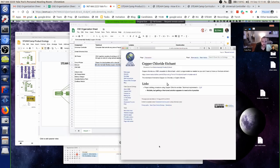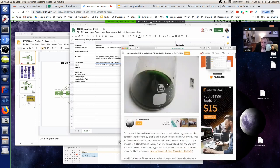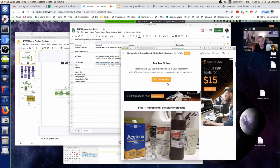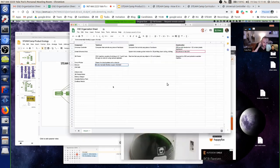And what do you do with that? You just put it on? You submerge the circuit in a bath, and then it etches it away after like 2 minutes. Cool. Is it toxic? It's recyclable. I'm not sure how toxic it is, but it's fully recyclable. You reuse it over and over. Copper chloride... I don't think it's too toxic. Not particularly.